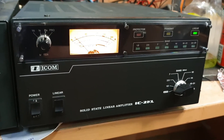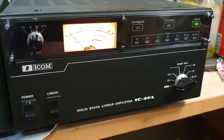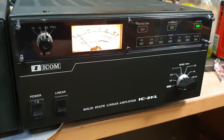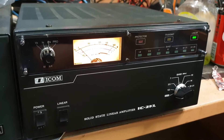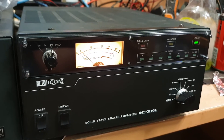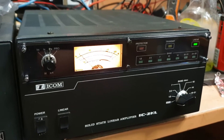These are a great amp. Look, if you really want to know the truth, run them at 350 to 400 watts all day and you will not have a problem. Try to extend the ALC and go crazy on them — it's just a matter of time. Components for these are getting much, much harder to get, hence my recommendation to run at 300 to 400 watts. They'll do 400 watts all day.